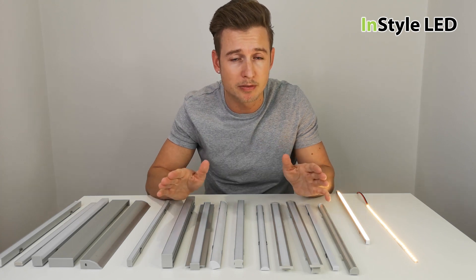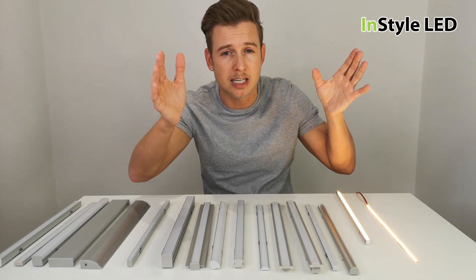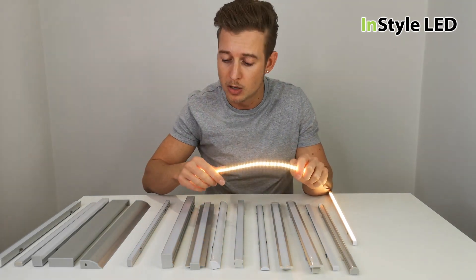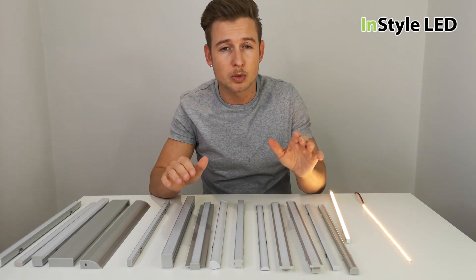Profiles are not used to diffuse the lights in terms of an effect onto the ceiling. With this LED strip, you will still get a completely diffused look within that coving whether it has an extrusion or not. So you wouldn't need an extrusion in that kind of effect where you cannot see the light source directly.